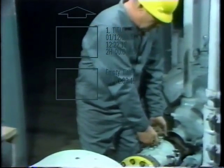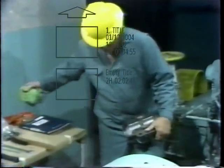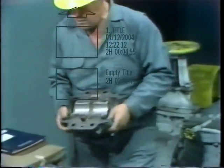With the four nuts removed, the top half of the bearing housing can be lifted off. This half contains the top half of the bearing shell as well. With the parts removed, he then wipes them off using a clean, lint-free rag to allow a visual inspection. We're going to discuss some more detailed inspection methods as we go along, but an early visual inspection can detect major wear or damage. After looking at it and finding none, he places the top half down on a clean surface.